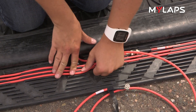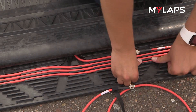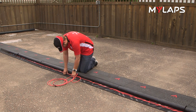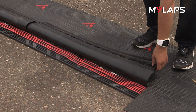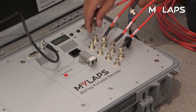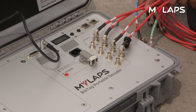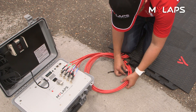As you continue to add more cables and work them through the trays, they will need to be fed through adjacent cable channels in the mats. Repeat the process for each additional mat you are using. When you are done, close the flaps on the mats. Hook the elbowed ends of the cables to your decoders, making sure the cable numbers match the corresponding ports. Arrange the bundle of cables coming from the mat neatly, and watch for kinks.